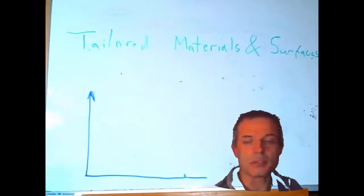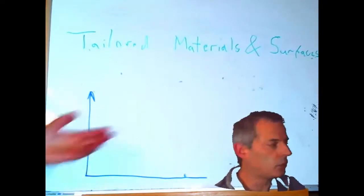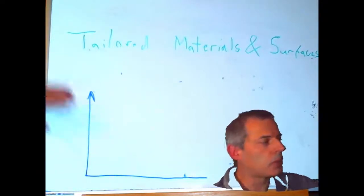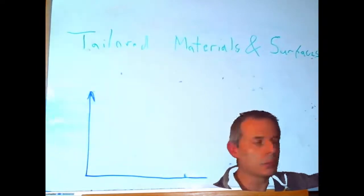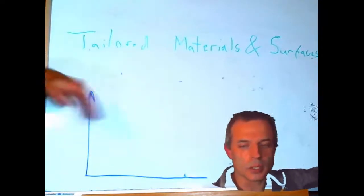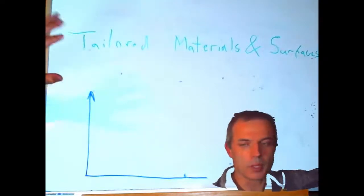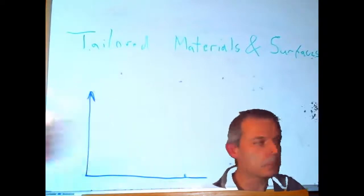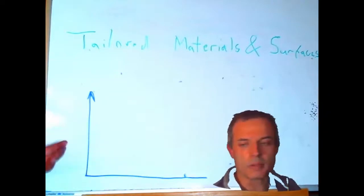We can see that if we take two copper electrodes and we do the electroplating, the moment we start to plate our copper, the voltage that we require is extremely low, because we only need to push one electrode slightly off equilibrium so that it's dissolving, and the other electrode slightly off equilibrium so that it's growing, and they will dissolve and grow. But if we have nothing in the solution, we have a starting problem.